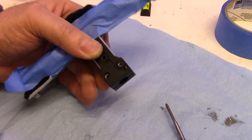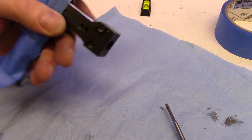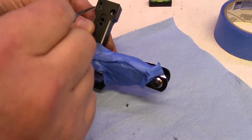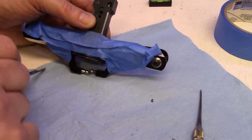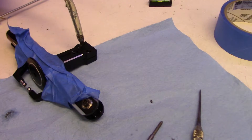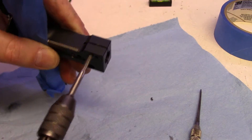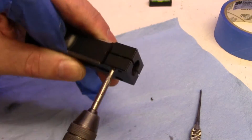I'm going to stop it here — I've got to see what's going on on the other side of the hole. I think it's actually coming out and being pressed up against the inside of the front hole. I was able to pick out a little bit of this — there was still a little bit of bolt wedged in there with this pick. I think that's all of it out now. I'll go back in, some more oil. If you don't oil it, you get a really rough thread.